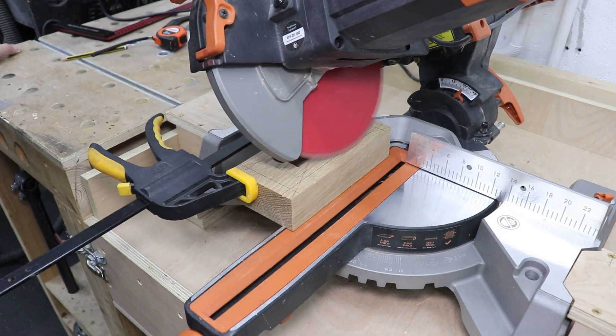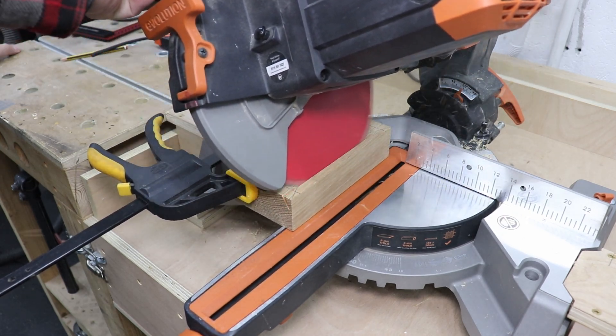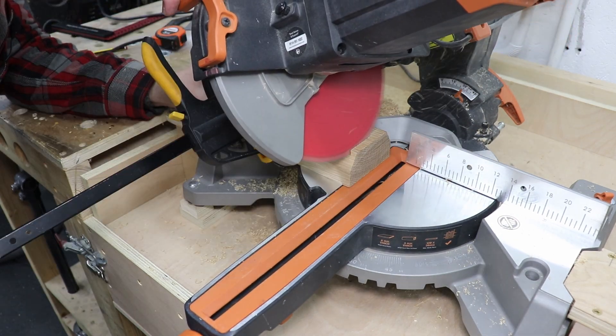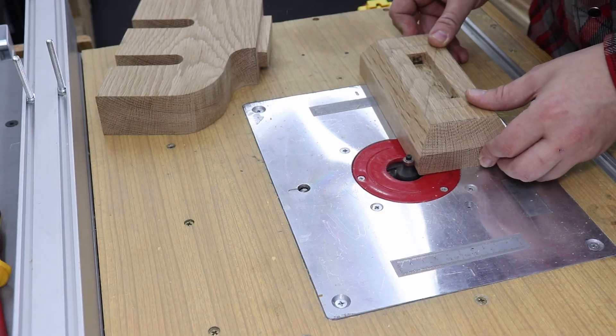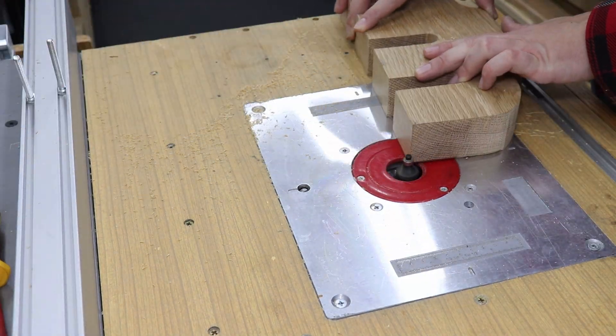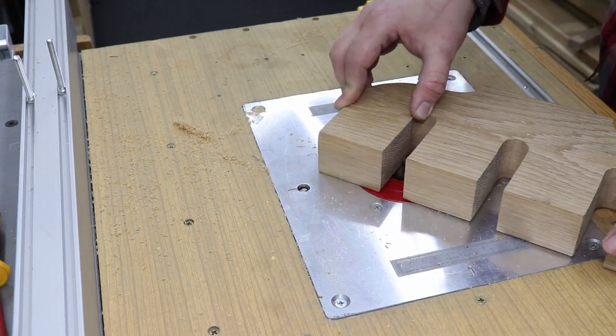It's now time to add the finishing touches to the base. I've changed the bevel on my mitre saw to 30 degrees and I'm just going to make a cut around the perimeter of the base. On my router table I've installed a small round-over bit and I'm just rounding over all the corners and all the sharp edges.